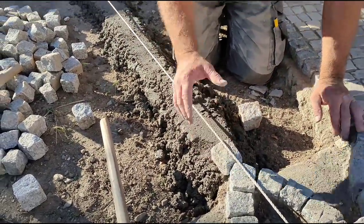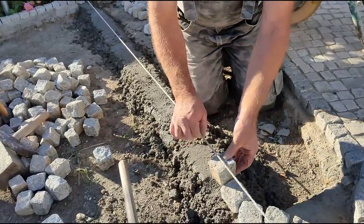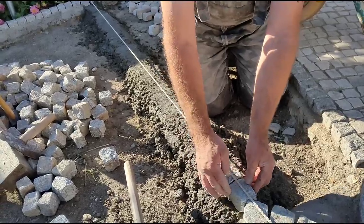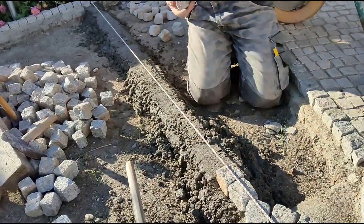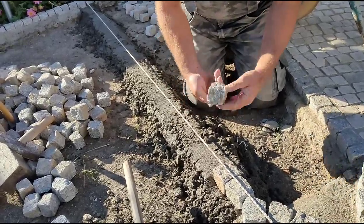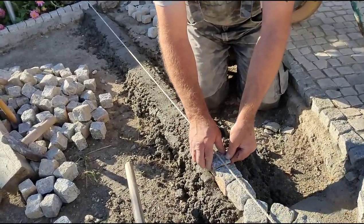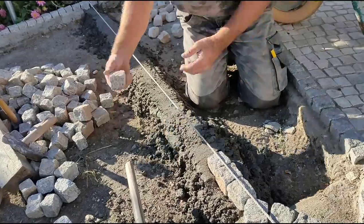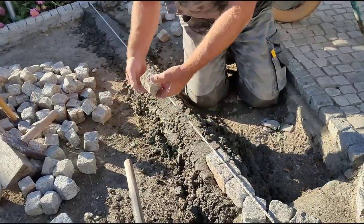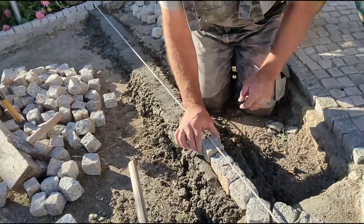So this is wet sand cement, so you need to be wearing gloves for this, obviously. But just for demonstration purposes, you're not going to be. Lift that up. Nestle it down so it just doesn't touch, yeah? And then you'll have a straight line because it's following the string. Some of these are obviously more rustic than others. Okay? And just turn that and make sure that every new one you put on is in the centre of that block, yeah?